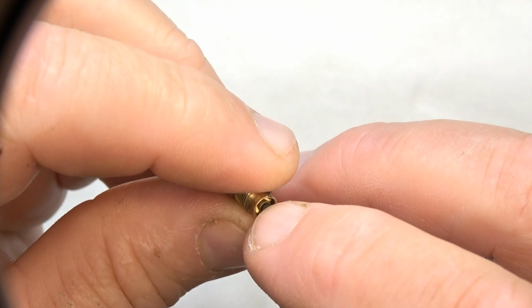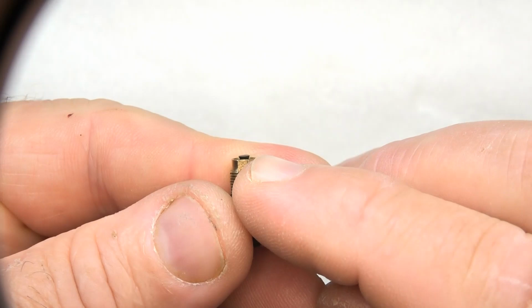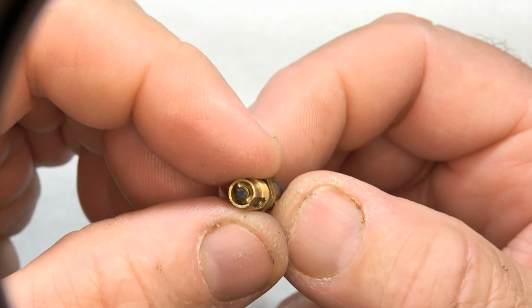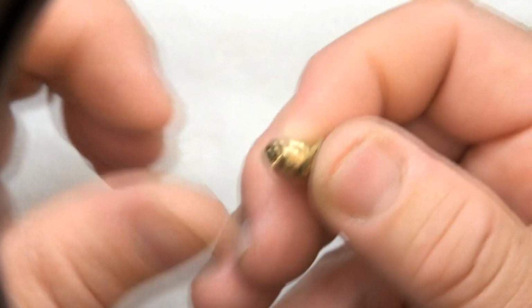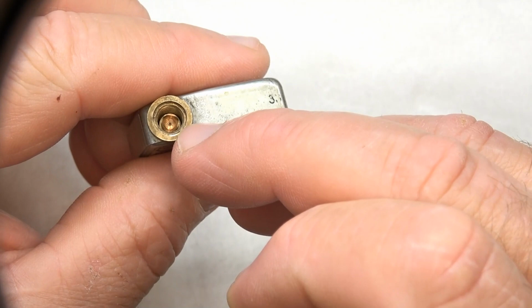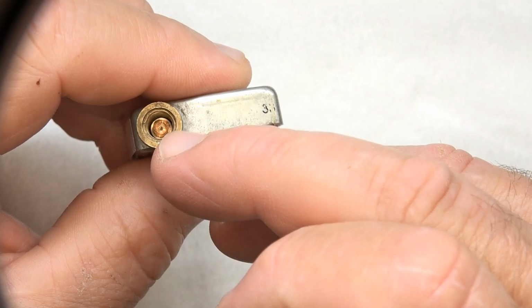I think I used a millimeter and a half cutter. Cut one out of an appropriate thickness, put in a sheet rubber. And you can see how this works. See, folks, here? That turns. This stopper is what plugs the main hole down inside here. But if you look down in here, see what we got here? When this thing turns, okay, this little valve area has some recess on it that kind of just forces this valve up. I'm going to take that out as well.